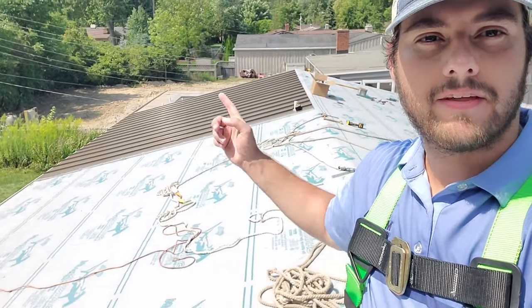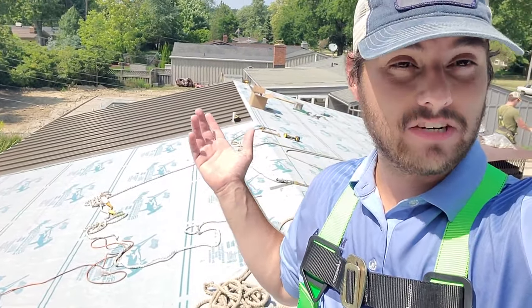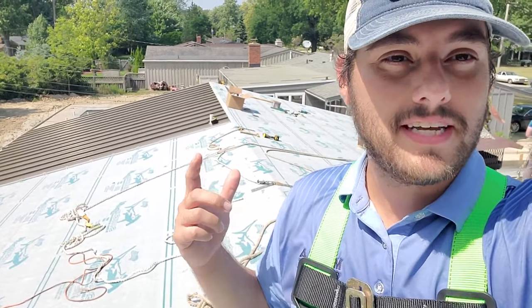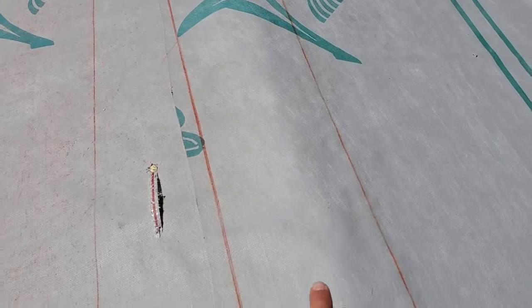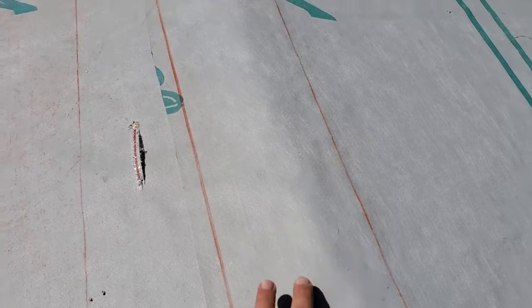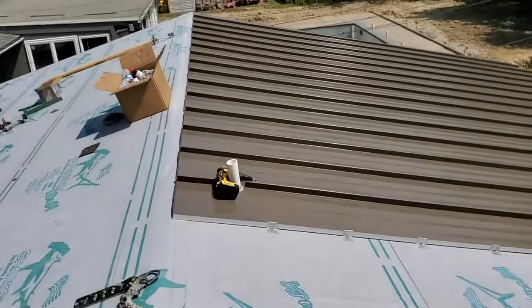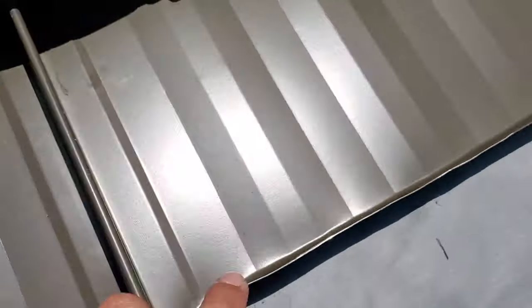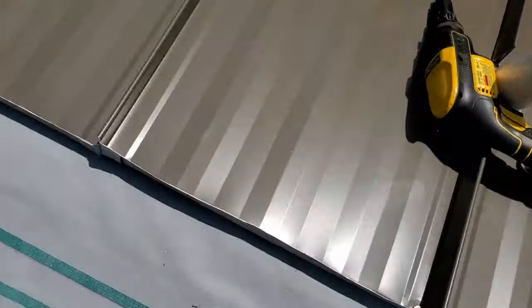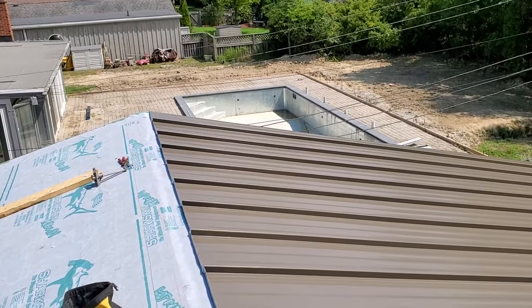So as you're paneling, the Z closure goes here at the top where you snap your ridge detail on. And you're gonna want that as even and as straight as possible coming across the roof. So one tip in order to be able to do that, here we have chalk lines spaced evenly between the ridge here on both sides across the entire length of the roof. And then over here, where the panels are going down, as each panel goes down, it gets marked right here, so that we know where that chalk line falls. And that way, these Z-closures will go down nice and even and straight across the entire length of the panel run.